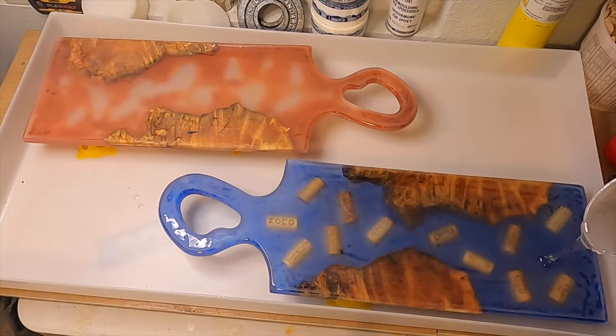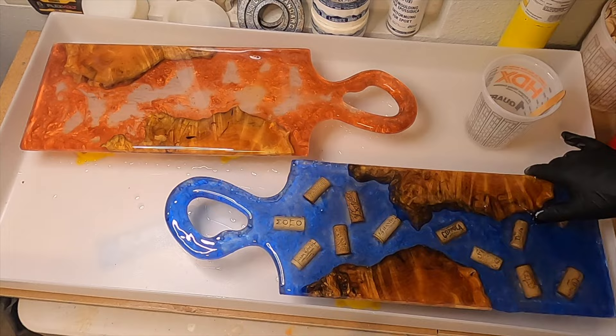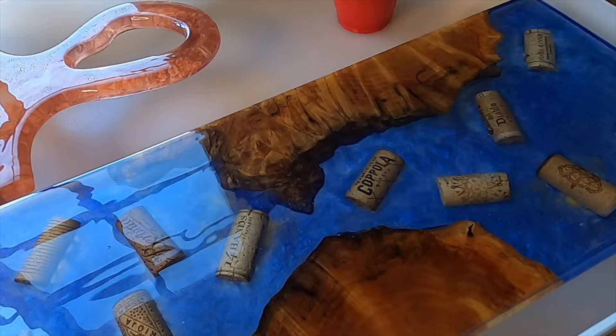Back to my pouring station for the flood coat. I'm going to pour an extra thick layer of epoxy, ensuring that it coats all the edges, sides, and top. The nice thing about this tabletop epoxy is it is self-leveling — all I have to do is make sure it covers the entire top and all of the sides. After letting the epoxy set up for a little bit I'm going to run a torch over it to pop any of the surface bubbles, then I'm just going to let it rest for about two days and make sure it's fully cured.